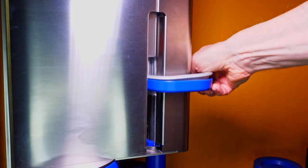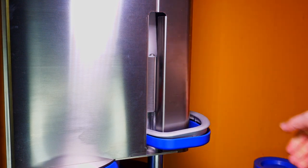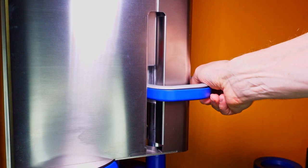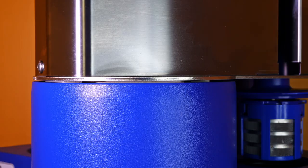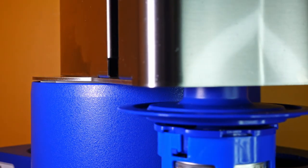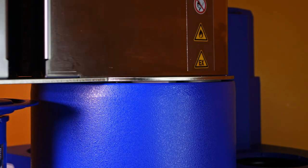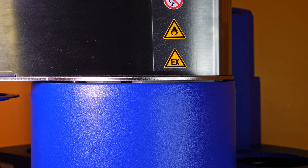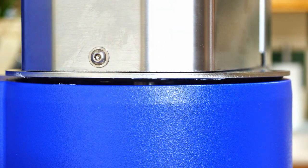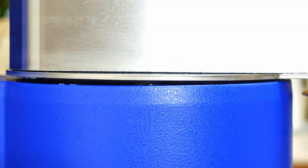The operating handle — the blue part is fixed, and the silver part is movable. You press the silver part, slide the handle, and it will lock itself in the position where you move it. I want you to observe the gap between the blue plastic and the metal — see how equal it is? It's nicely aligned, it's parallel. This is the unit I received before this machine I have now — see the difference? This one is not straight. I can only assume that it was turned upside down during transport and got bent — something to check if you buy this machine.